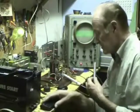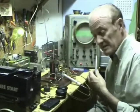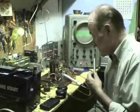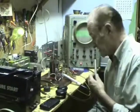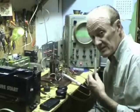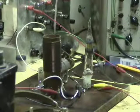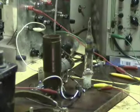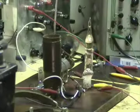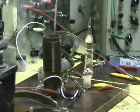When I was doing that experiment I noticed that a too-bright filament is not a great idea. I suspect because my tube is a bit gassy, you have to have the electron emission just so, or at the B-plus voltage I'm using — which is about 120 volts — one probably gets ionization in the gas. Here's a close-up of my radio with the tuning coil, tuning capacitor, and my tube. I'm going to turn that on so you can see how bright the filament glows — it sort of lights up like a little lamp, but that's as bright as it wants to go before the radio operation actually gets worse.